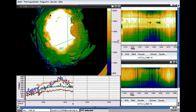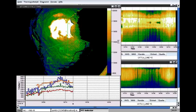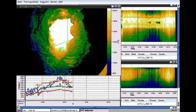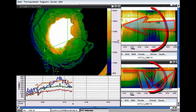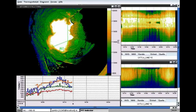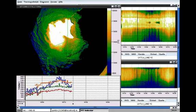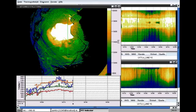This is how it looks like in real life. This customer has installed a burner with two tubes, one for the primary fuel and one for the alternative fuels. As you can see, the polylines are moving from right to left and are indicating a massive change in the flame. The upper polyline shows the vertical flame diameter, and the lower polyline is banded and shows the coating, the flame diameter, and the lower burner tip temperature.